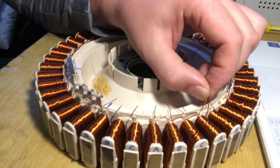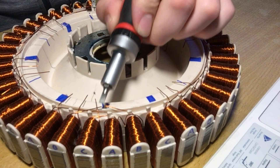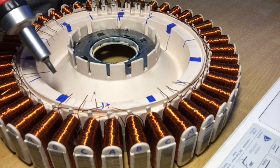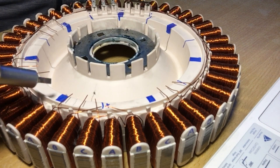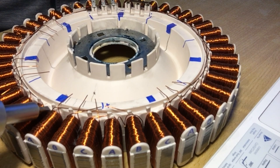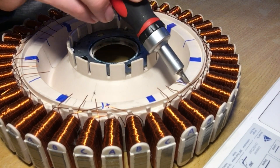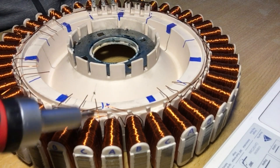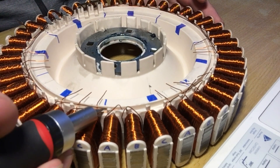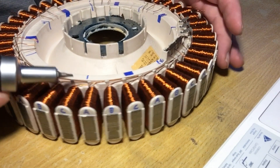Continue around seven more times. It's very easy to cut the wrong wire — in fact I just did right here, so I've put a little X to mark that I need to fix it. The thick blue lines show everywhere there's going to be a break for the second lot of coils, and there's never going to be any wires crossing where that is. The smaller line is the middle, and that's where you'll have the most wires.